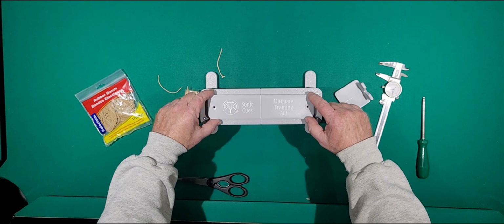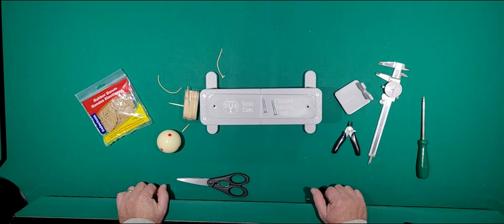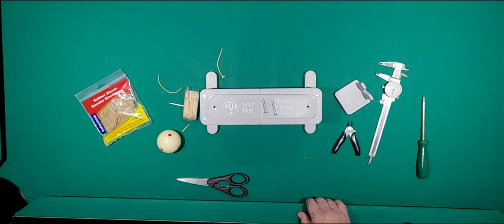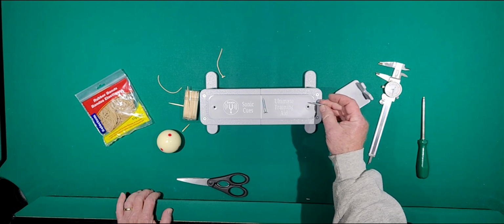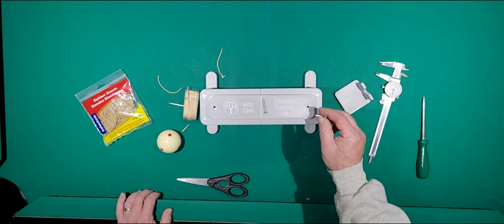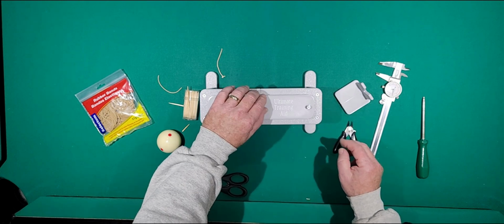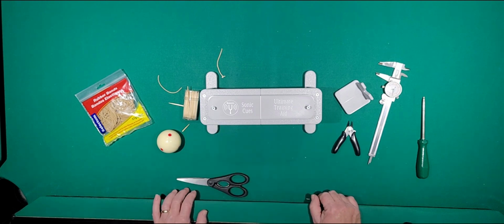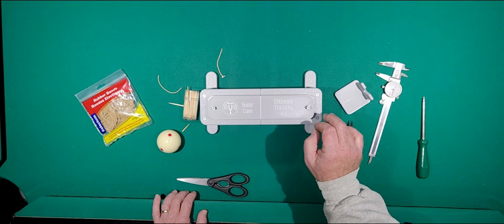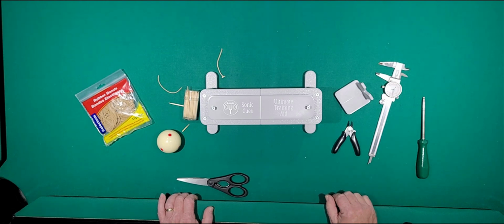Drop that on there. Now, like I said, we're going to try and use the exact same thread that those screws cut originally when they were put together. They started out as a nice clean 3D printed hole. That's just the right size for these screws to cut thread into and be strong, nice join. But we don't want to be cutting a new thread every time we put these screws back in. So the way in order to find the existing thread is to drop them in and with a gentle down pressure, rotate them counterclockwise, backwards, until they fall down into the beginning of one of the threads, if there's more than one. Should only be one, but you may make a mistake.